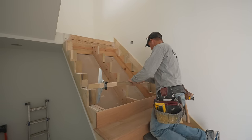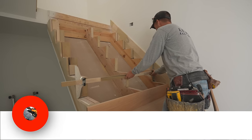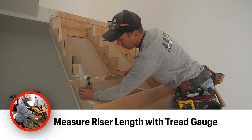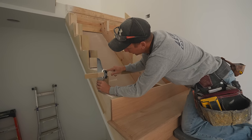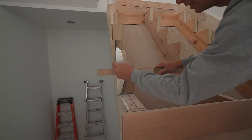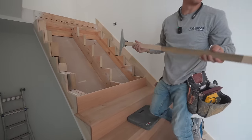We'll start by getting our length approximately right. I'm going to loosen one side and get it tight on the end so that it's tight up against the skirt board the whole way. Then I'll come over and get the end of this tread gauge lined up with the edge of my skirt board. I'll tighten that down — nice and flush on the outside. I'll double check the other side and it looks good. Now I'll carefully pick it up and go do the cut.